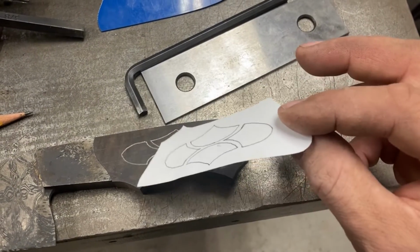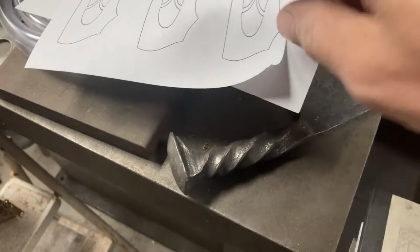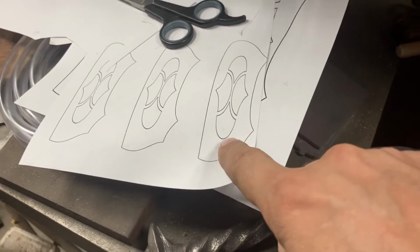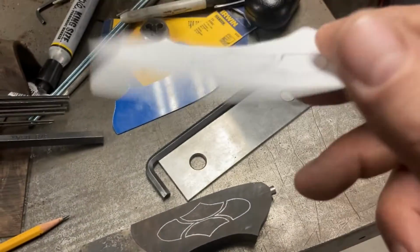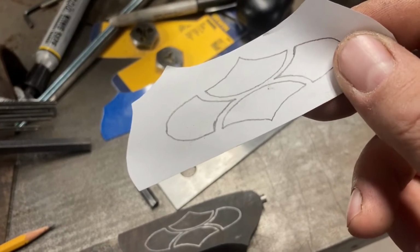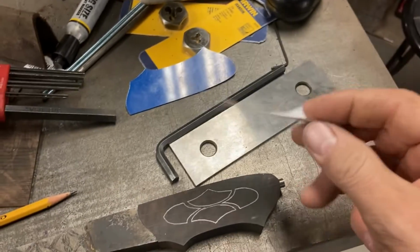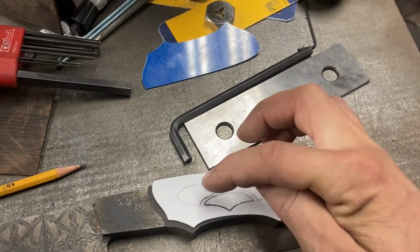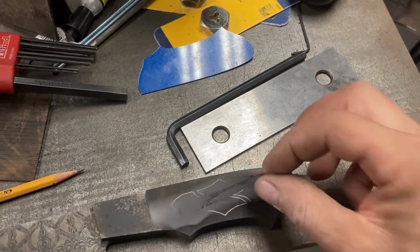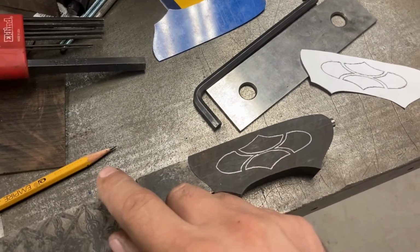So I took just another one of these pattern pieces from the cutout from the sheet of actual size pattern printouts, put it up against a window and carefully traced the back side of the drawing to put lead on there. Then I put it back on this side, held it carefully within the profile, and drew hard over it on this side to press the lead from this side of the paper down onto the surface of the wood, which gave me a pretty good transfer, and then I just went over it with pencil.